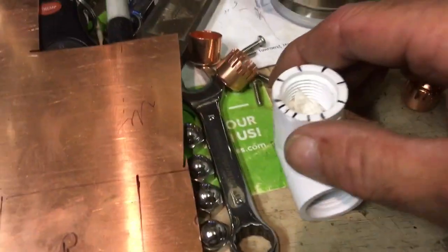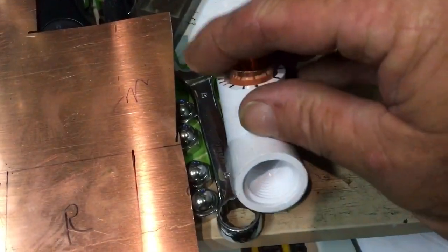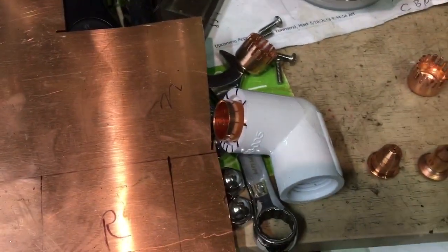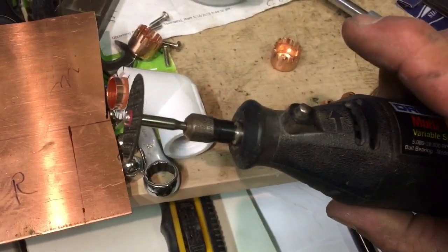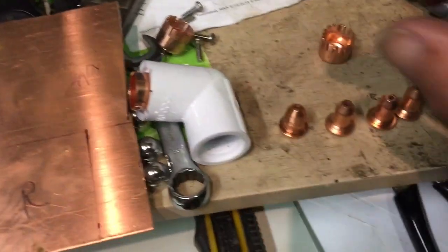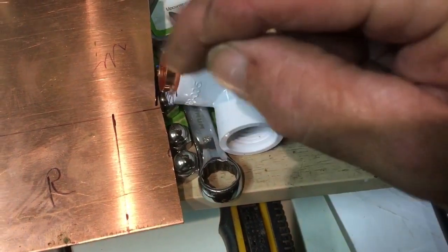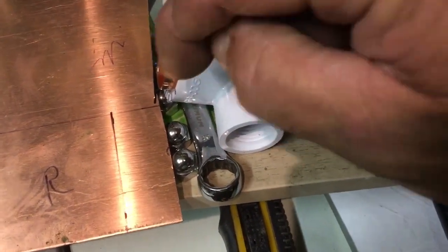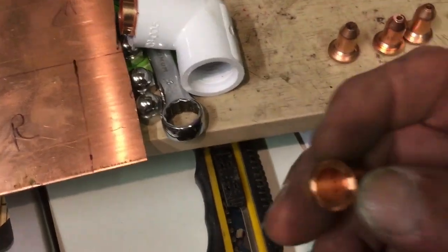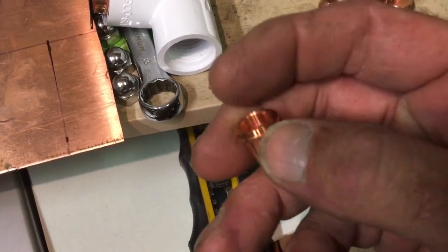I made up a little template, drop it in, and use it to figure out how I'm going to cut it — I'll do it right in my lap with a cutting wheel on my Dremel. Takes a little bit of time, but no issue. I marked the height with the template, took my Sharpie, went around so I have my height for sure. Then I do all the down cuts, come back with the cutoff wheel and get right to the line on each one. The down hole is the bigger one — I'm going to solder on a little piece of half-inch tube that sits right on there.